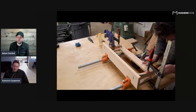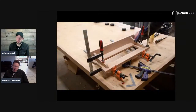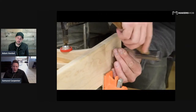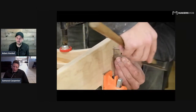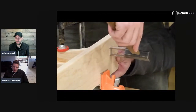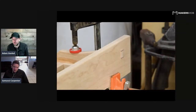And the corbel is also going to tie it all together too, right? Yeah. The corbel part, I put the dowels in the back, which you'll see in a minute, but that glue joint's going to be super strong just as it is. The dowels were for added strength, an extra one for good measure. And then just slowly putting these in. You don't want to pound these wedges because you could easily split the piece. So I was just pounding the wedges until they filled the tapered section of the mortise, and then just zip it off and give it a little sand.